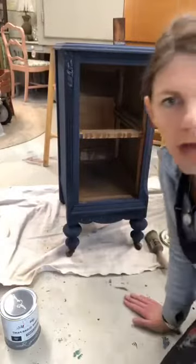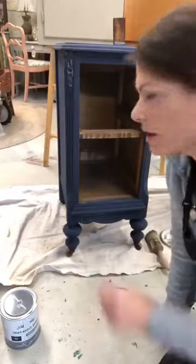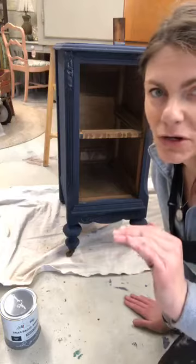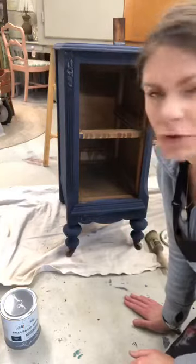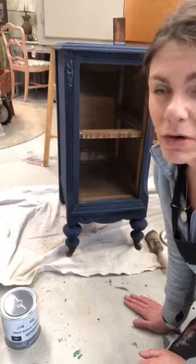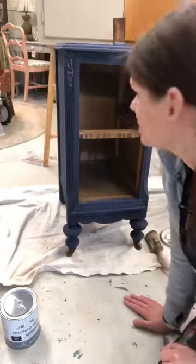So far what I've done — I took a little poll on Instagram to see what color I should paint this vanity. I wanted to paint it Paris gray, and that is what I put the first coat on, but I was having some really weird bleed-through problems. You could see the tannins of the wood coming through. I tried shellac and one coat of that didn't work, and I also wanted to paint it navy, so I just went with that route instead.